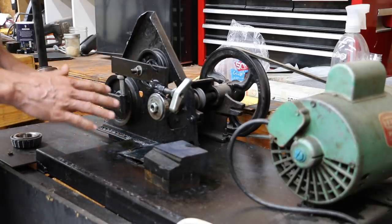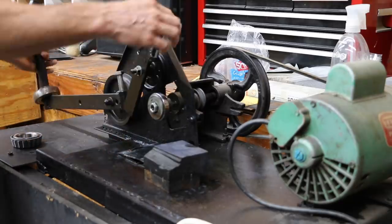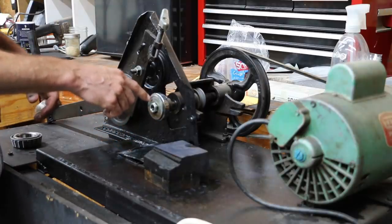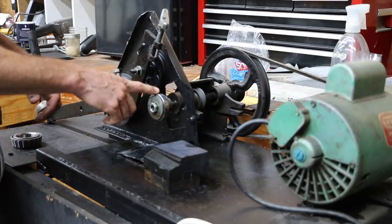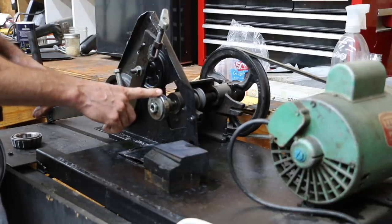During my testing process, to avoid any manipulation, I never touch this arm during the test. My procedure is straightforward. The first thing I do is clean off the wheel race using 1500 grit sandpaper. That removes any old oil additive that has been tested on the wheel race, and it also allows the additive I'm testing to have something to stick to. A 1500 grit gives it some roughness that allows the product to stick to the wheel race.